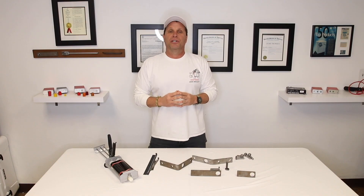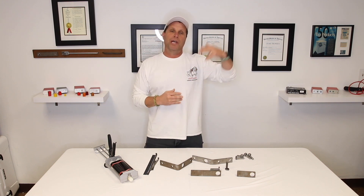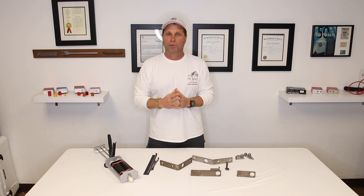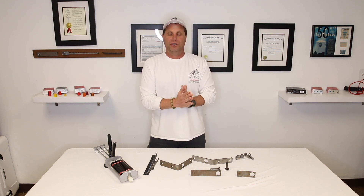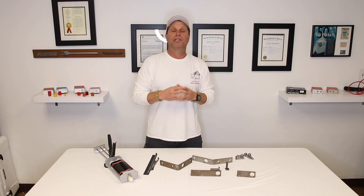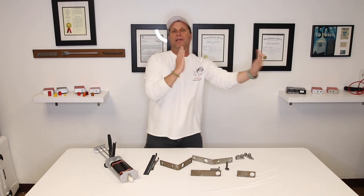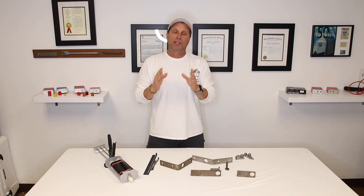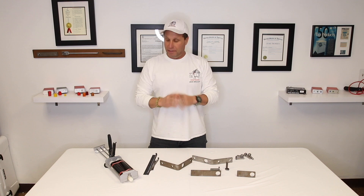I've tested this over the years. I've done structural repairs where we actually dig out the backside of a pool and we can see that we don't get any penetration as far as that's concerned. When companies say they show you port-to-port penetration, all you're literally seeing is what's on the surface — most of the time you're pumping epoxy behind the wall and it's dripping down, not getting into that crack. Epoxy injection could be good on anything above ground where you know you're getting full penetration from both sides, but on a swimming pool application, it's a waste of time and money. Don't do it.